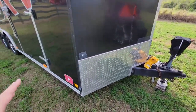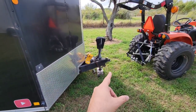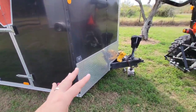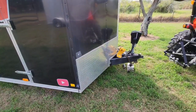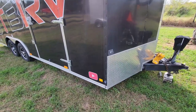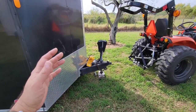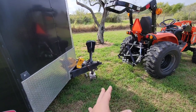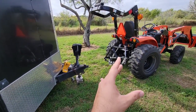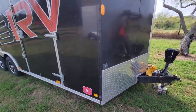The trailer is pretty much empty right now, but if I did have anything in here, I certainly wouldn't want to put it behind the axle — I'd want to move weight towards the tongue so there's no chance of it coming undone and smacking into the ground if I hit a bump. I also want to make sure the tongue jack is up and won't hit the ground. This is very similar to how a dealership moves trailers around — they'll simply take a forklift or tractor, back up to it, lift the three-point underneath it, move it where they want, and drop it off. We're going to use this setup right now and see what our maneuverability looks like.